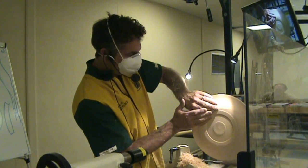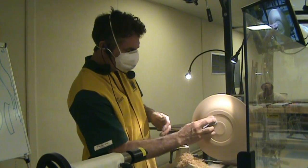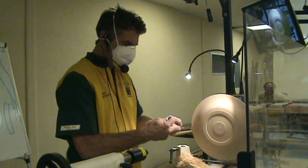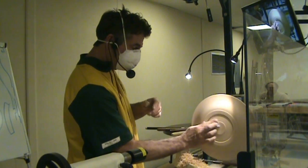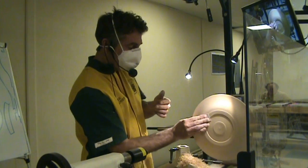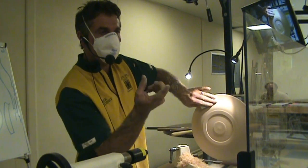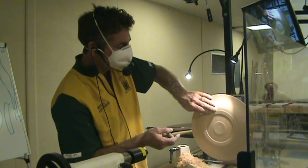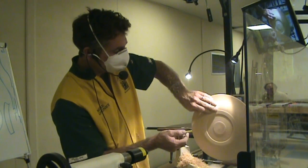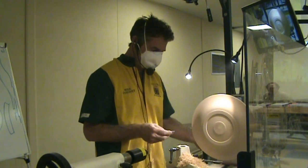There's 150, a little bit of rub there. 220. At home I would spray between each grit — take high pressure air and knock all the 150 grit off the wood, because that's going to destroy the next paper. Grit also breaks off and gets into the wood. I also move the paper around quite a bit so the heat doesn't build up, and then I discard it.